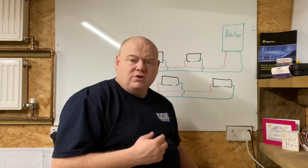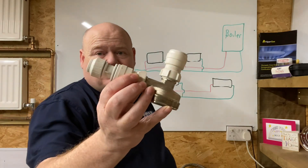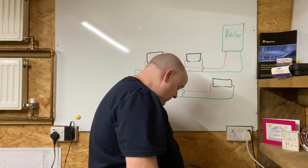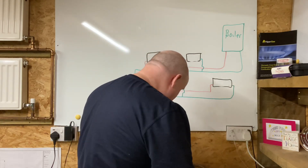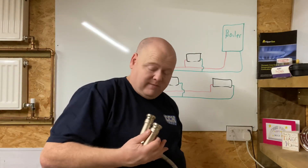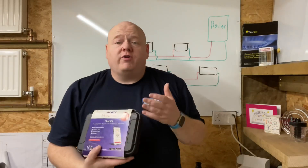There are different adapters depending on how you use the filter — you can use it as a drain or connect a power flush machine to it if you want. The AD ones use the same connection as the Magna Cleanse. Another option when flushing is a full system power flush with the machine. When you arrive on the job in the morning you could connect the power flush machine straight onto it, though without a heater in your machine you'll just be pumping cold water around — which is okay.